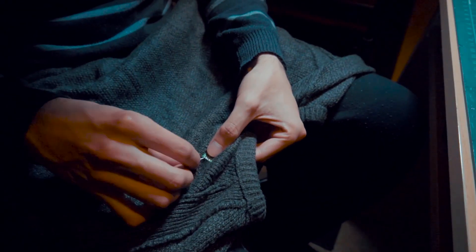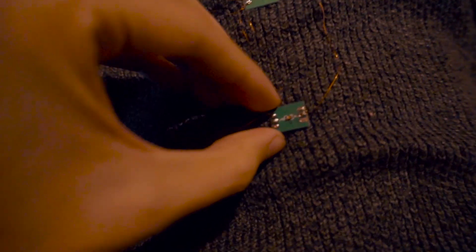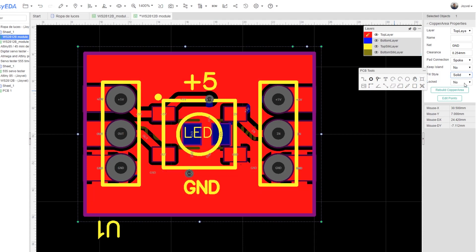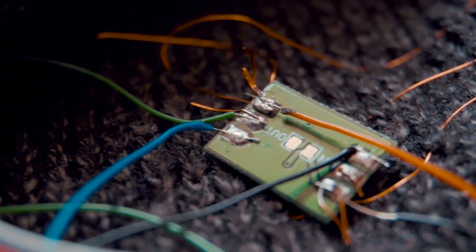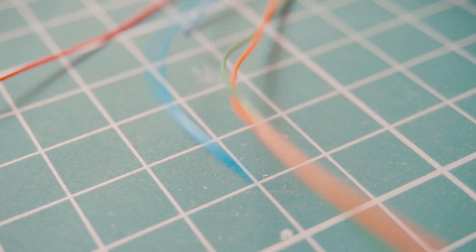In the first version I did in a previous video, I managed to place few LEDs on a sweater. That first version was a bit complicated to achieve and the designs of the PCBs where the LEDs go was not the best. The PCBs were very small and when using conductive thread they made contact between them due to the little space available, so I had to use small cables and enamelled copper wire to solder them in their respective places.